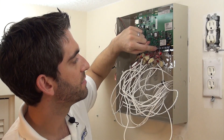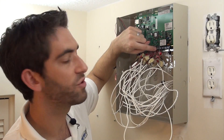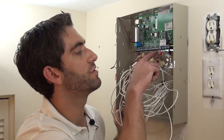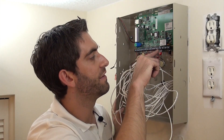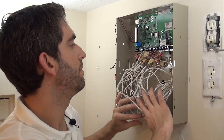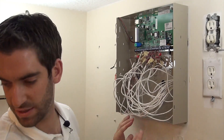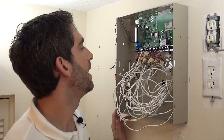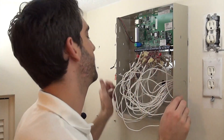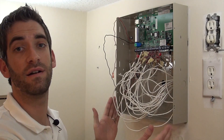Getting close to finally — we have Zone 7 matched with Zone 14 running parallel to Z7. 3K matched with Zone 7, 6.2K low side matched with Zone 14, giving us 7 and 14. And finally, Zone 8 — because we do not have a Zone 15 — is our last connection, running just one zone on Zone 8. Fit all these wires in, get our panel door. We're good to go at the panel. We still need to add our GSM, and attach the battery and power up. But that's after we get our GSM board — that's our quick lesson on zone doubling.